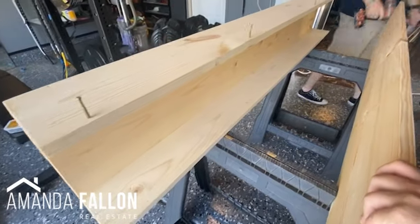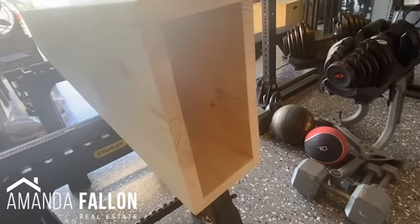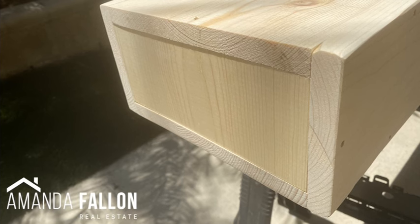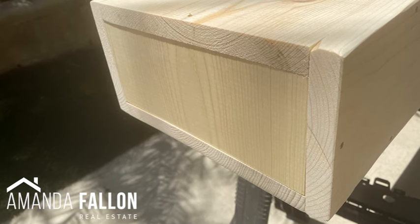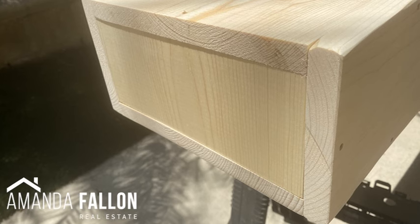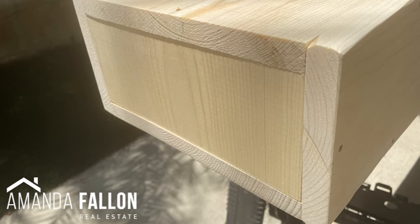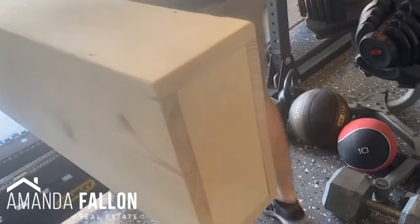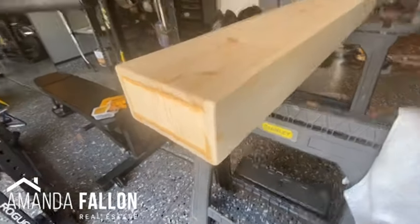We don't use any wood glue. Three sides are installed and now we're going to install the bottom. The box is fully assembled — we're just missing the little end pieces, so we're going to cut those right now, get them installed, and then wood fill and stain. To create the end cap, you're going to take a board the same size as your top and bottom board and cut it to the length needed to fill in the gap. Use trim head screws — one on the top on one side and one on the bottom on the other side — then wood fill with stainable wood filler behind the screws to cap it off.